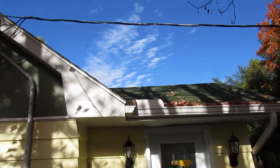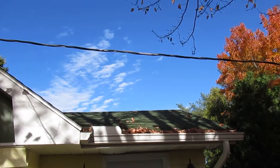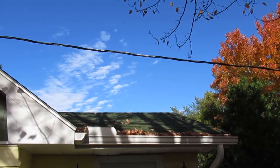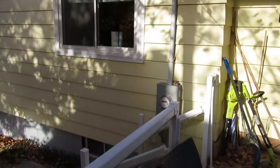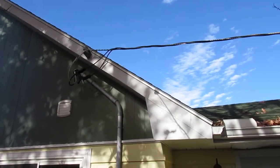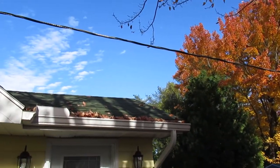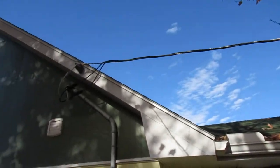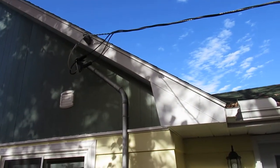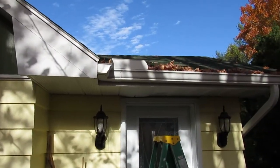One important thing to mention: there's electrical wire here, and you should always assume the insulation on any wire is bad — never expect it's safe to touch. This is 120-volt house wiring going into the meter. Do not go anywhere near anything above that voltage — definitely do not go near a pole line or anything like that. The service entrance to a home with the breaker panel shouldn't be a problem, but be aware.